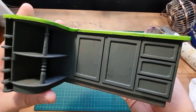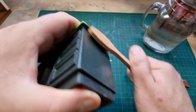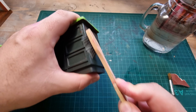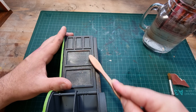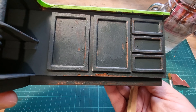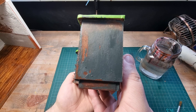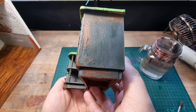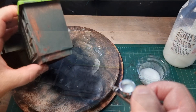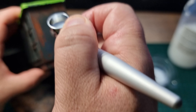Once that had dried I took some water, a toothbrush, and a stiff paint brush and started to rub away that top layer of emulsion sitting on top of the chipping medium. It really doesn't take very much to remove that top layer of paint, and being water-based emulsion made it even easier. I paid particular attention to where feet would touch the kickboard at the sink, the wine rack where you'd take bottles on and off, and shelves where you'd be pulling out plates. I then masked off the top of the kitchen counter and sealed everything in with a gloss varnish.